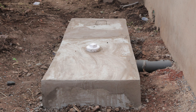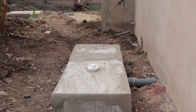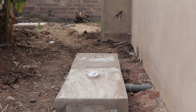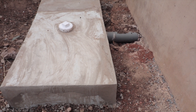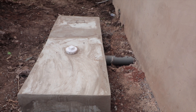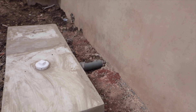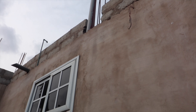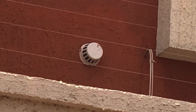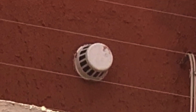We sited one of the digesters right here and did the pipe connection ourselves because it was going to be very close to the inlet coming out — and this is what you can see. We also provided a clean-out on top to serve as an inspection chamber in case it needs to be looked at in the near future. The top one will also come and join this one when it's done in the future, and the idea is also to have a vent pipe or vent outlet at the top for this particular biodigester.